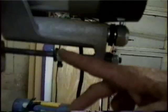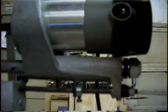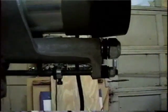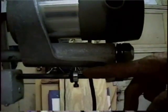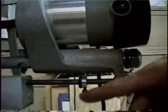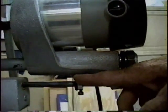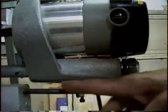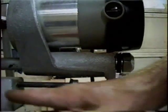This is important if you have a glass door or something. If you don't have a glass door, it's a wooden door, but you still don't want to go too far because this thing has a 5.5 inch throw to it. You don't want to come through where a panel is. This is your last adjustment right here. As you will see, I'll show part of this as we're working this thing in, how it steps as you keep turning it.